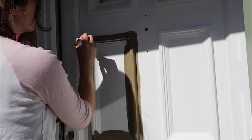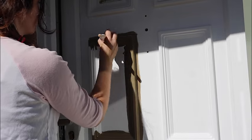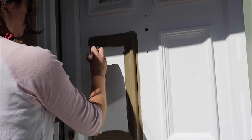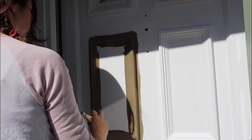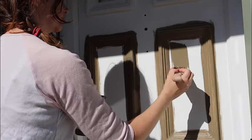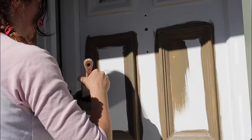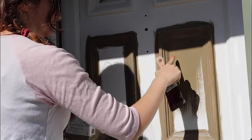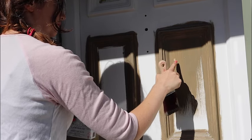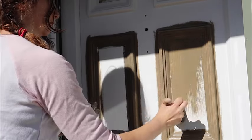This is painting on top of Slick Stick rather than the original door, so it applied the same as it would on a wooden surface. If you've ever tried to paint on something shiny or laminate and you get a washed-out look, that is what this paint would look like if I hadn't done that coat of Slick Stick first. I started by painting all the ridges and getting into all the little details, and then went back with the roller for all the larger sections. It's a constant process of finding hairs from brushes or in the paint — the downside of having several animals in the house.